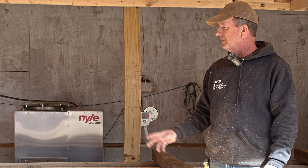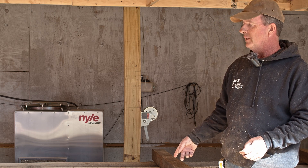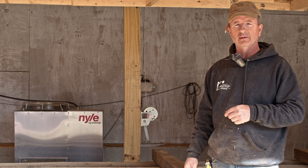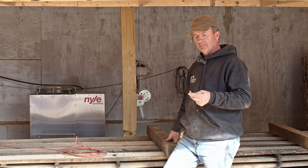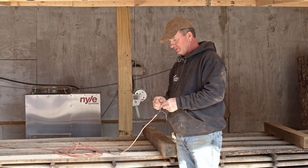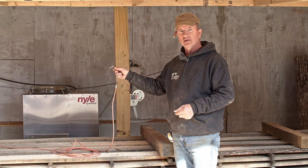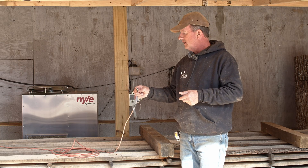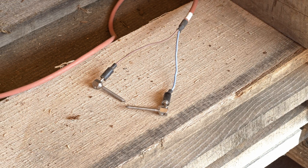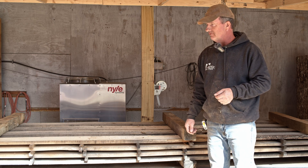When I say six to seven weeks, that's because it was white oak, which is hard to dry — same with walnut — and it's only one inch thick. We did have some two-inch wood that we have to put back in because it'll probably take eight to nine weeks to dry. One nice feature of these kilns is we can screw probes into the wood and plug them into the unit, and it will tell us the moisture content from outside the kiln so we can constantly monitor it. Though these probes work well, I still like to check with the moisture meter when we take the wood out. We're going to go ahead and start filling it back up.